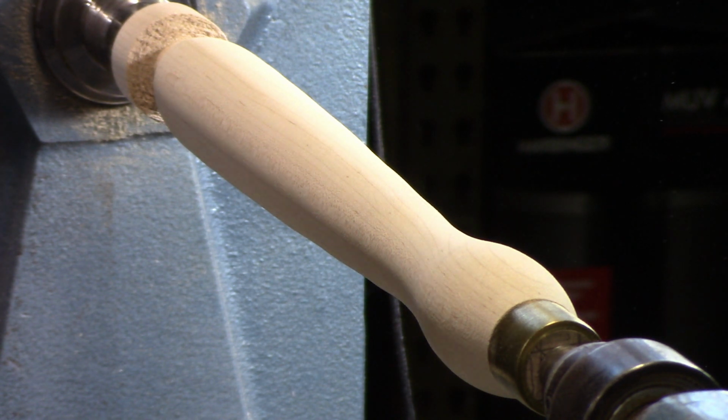These are basically discs that have kind of a flannel back on them, and it sticks to the Velcro. These are just solid round discs. They've got some other ones that have little ears that come all the way around them that actually work better up into corners for inside of bowls and things like that, and I like those a lot better, but they both have their place. It's just a matter of getting these centered on the Velcro. They have a tendency to curl. Get it centered on the Velcro and tap down.